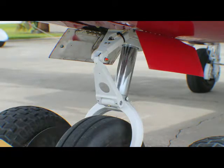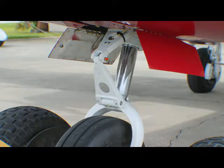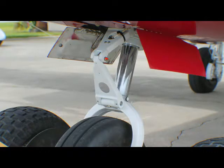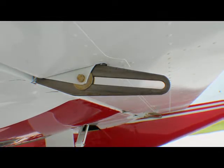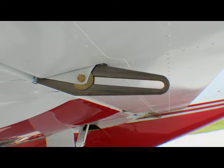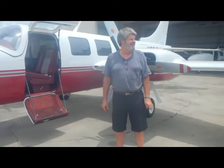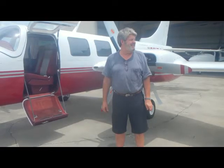A very nice job on the nose gear. The scissors bolt is soon to be replaced with a pilot-removable T-handle pin to allow for torque link bushing inspection. It might also occasionally be removed to preclude towing damage. Marsh Brothers' next Aerostar offering will be grease-free flap rollers, allowing the flap tracks to stay free of grease. It took Jimmy about a week to fit everything, including a delay due to having to exchange some parts on one gear leg that was fitted incorrectly.